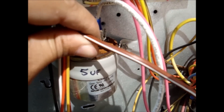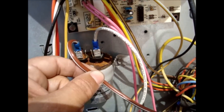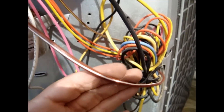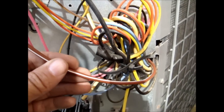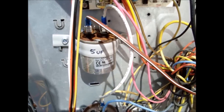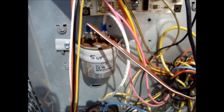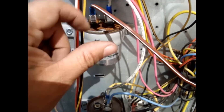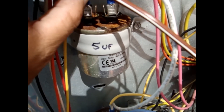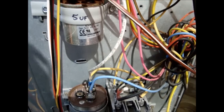You'll see the white stripe — don't freak out, everything is all right. I just used this wire, cut it off the motor, since I wired it up as a three-wire hookup instead of a four-wire, and I used this to extend my fan lead up into the cabinet because the wires were too short — which is probably why the previous guy put the capacitor down under the condenser fan motor. Just take a little pride in your work, take an extra five or ten minutes and do things right. I labeled this bracket so next time I come out I don't have to take it off — I know what size capacitor is there. Just make things a little bit easier for us.